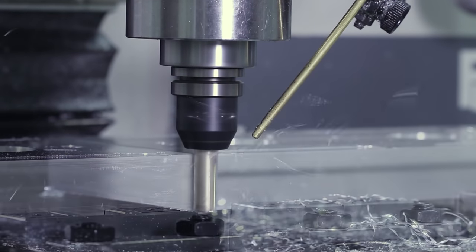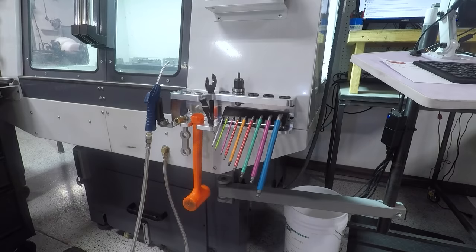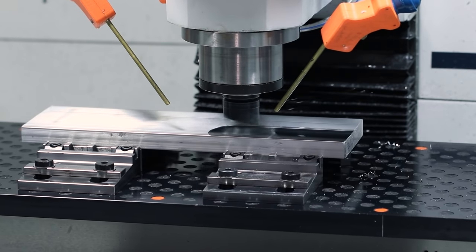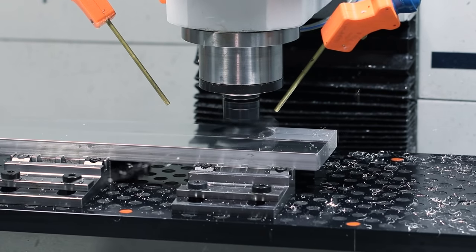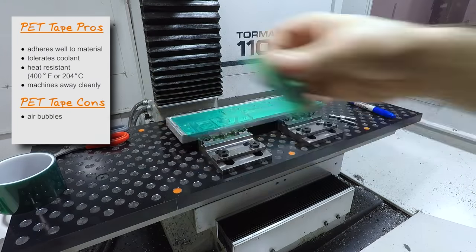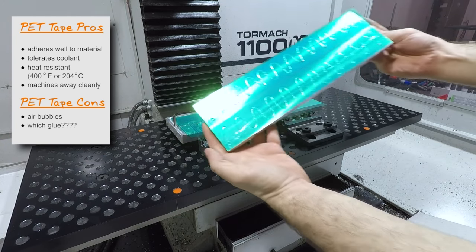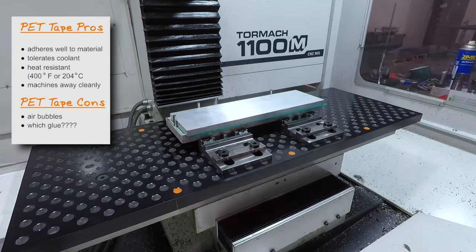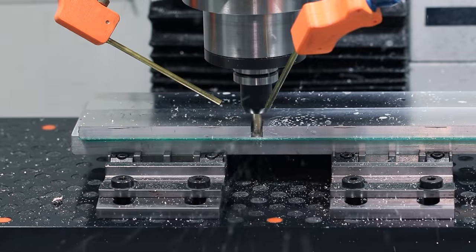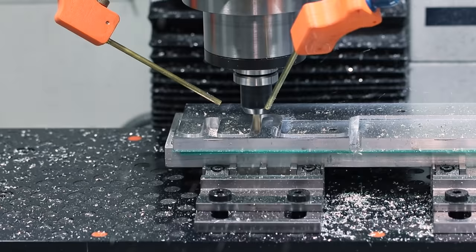We did a similar workflow in widget 249 when we made this Tormach accessory rack, except it's not exactly what meets the eye. We actually used the pair of mod vises to hold a piece of aluminum that we then decked. That gave us a really flat plane that we could use with this super glue technique. We temporarily installed dowel pins, which allowed us to easily and accurately locate our raw material while super gluing it, but we can then remove them to gain full access to the profile of the part. We'll have a whole separate video dedicated to that technique, but it's a really good way to give yourself a very flexible platform to hold larger parts.